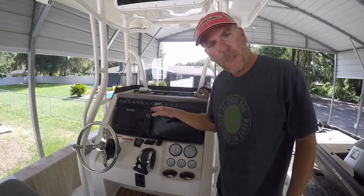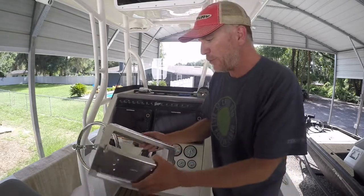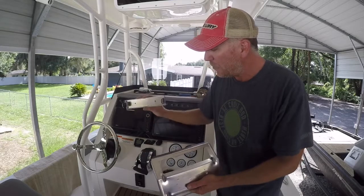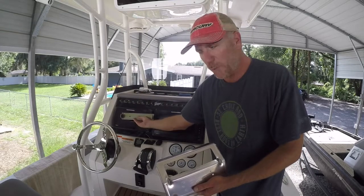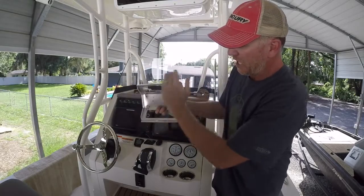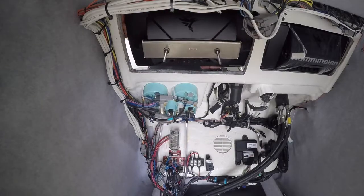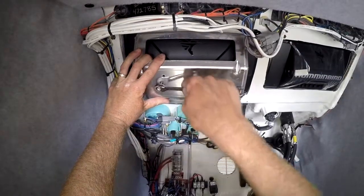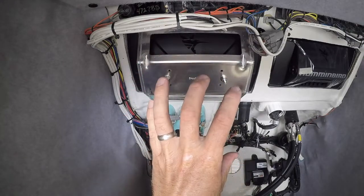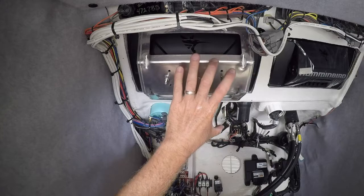All right, so we've got both of our depth finders flush mounted here in the console. Now it's just a matter of using the flush mount adapter that you get for Humminbirds and hooking them up. By far the simplest and best flush mount out there from what I've found. This just hooks into the knobs on the side and the back of your unit, just like a regular gimbal mount, just like a standard mount — real heavy-duty aluminum — which then comes in and bolts into this piece, which kind of sandwiches back against the back of your console. All that tension of those two big heavy aluminum brackets pulling on each other with two simple screws and lock nuts, and everything just holds perfectly tight. This is by design: the more you crank them down and compress them, the more they flex and open up just slightly to build even more pressure to hold the unit in.